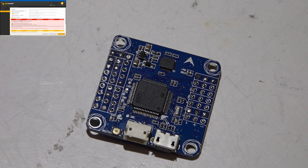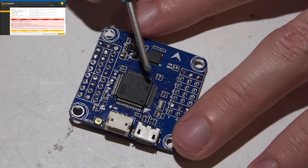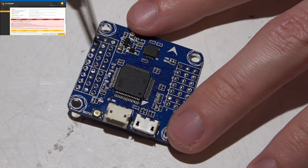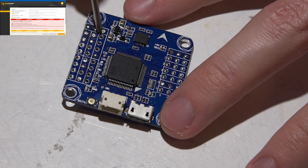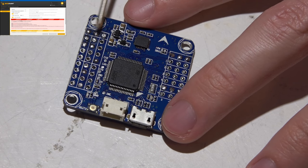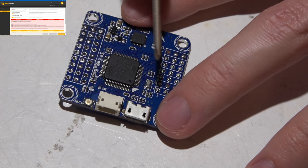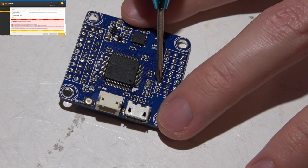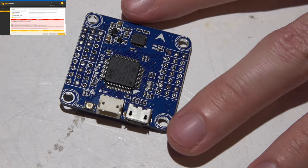The only difference between the firmware, and I've looked at everything, is they just remapped these pins to make the buzzer work and the LEDs kind of work. Like I said, they messed up the circuitry in here, and you still have to run power and ground on the same pins you were supposed to use for LEDs, except your LED signal pin will actually go to motor output number 5 signal pin, and then they will work.